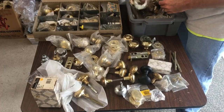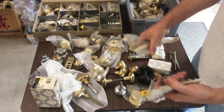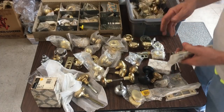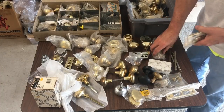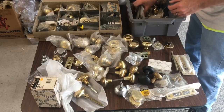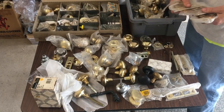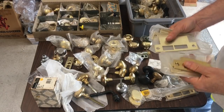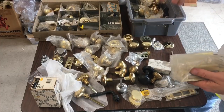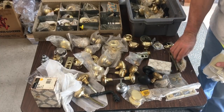I need these for sure — this back plate. Frequently, people will put the strike plates on without that security plate and long screws. And then here we have one for a bevel or a rabbeted door. A little rosette — this can go over here. It's the strike plates, including long lip ones, which again you'll frequently run up on. People will use these short ones and their door frame is long, and you'll see where the latch is scraped into the door frame. So you need these longer ones to cover that jutting-out frame.